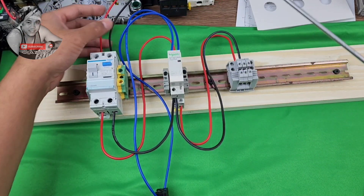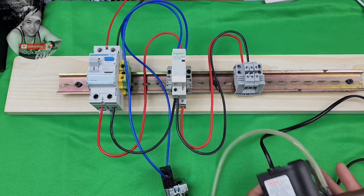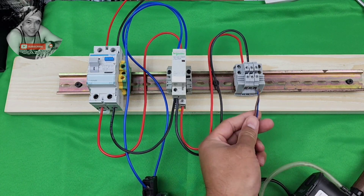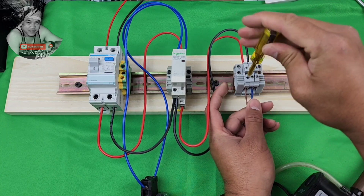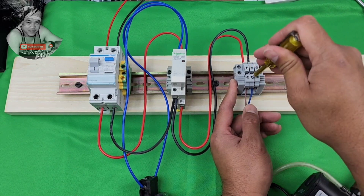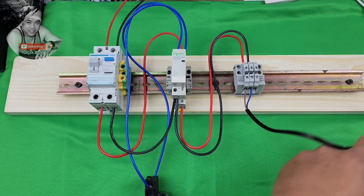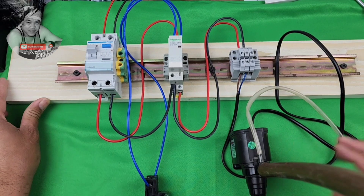So now we have the main power already. We will connect the single-phase terminal one for this dummy motor, for testing purpose only. Brown is line. It's just only single-phase and it doesn't have the earth wire, so it's just only for testing. This third terminal is for your earth. I have a 220V motor now, so we can energize it and we will do the testing.